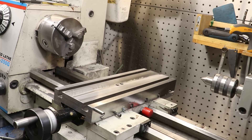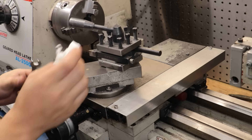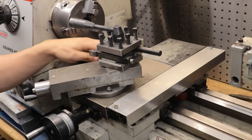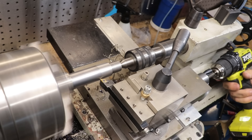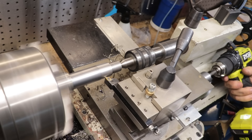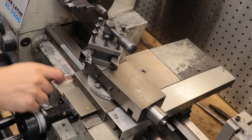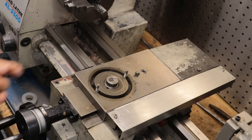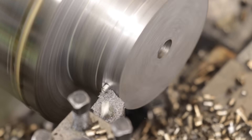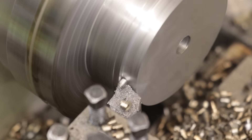For the next stage of the project it's going to involve making a new compound and tool post. The lathe came with a very standard swivel type compound generally used for cutting tapers, and this design wasn't very rigid at all. You lose a bit of rigidity with the slide itself but most of it was being lost at the mount — it was only held in place with two M6 bolts, which really isn't a lot considering I'm trying to push this lathe to do two millimeter cuts in steel.